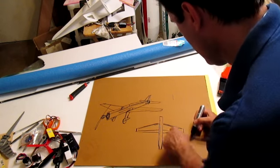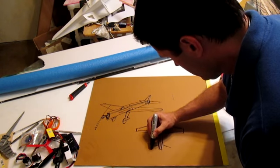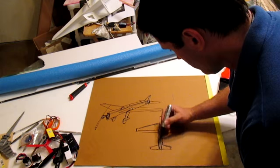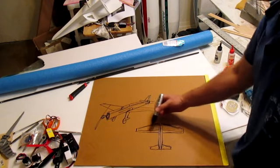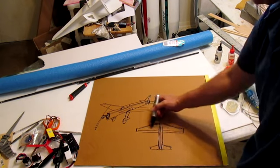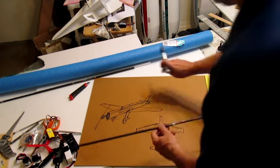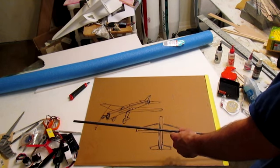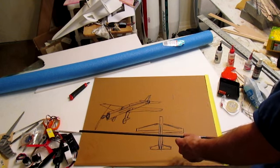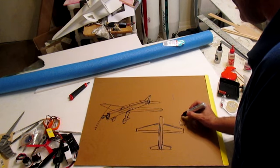There are your ailerons. And this is going to be aerobatic 3D. Same thing, we're going to mimic the elevator, and stabilizer will mimic the sweep of the main wings. The elevator stabilizer will be 1/3 the wingspan of the main wings. The main wings, I'm thinking, are probably going to be roughly, I want the wingspan to be greater than the overall fuselage length. So I'm thinking for the main wings, 32-inch wingspan on the main wings. 32 inches for the main wingspan, right?